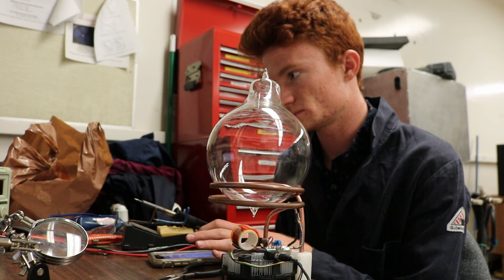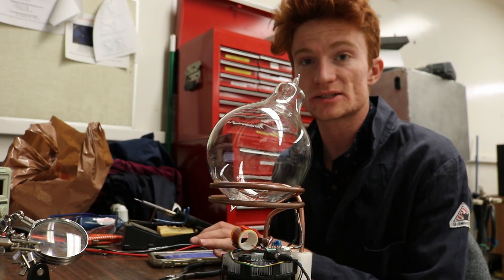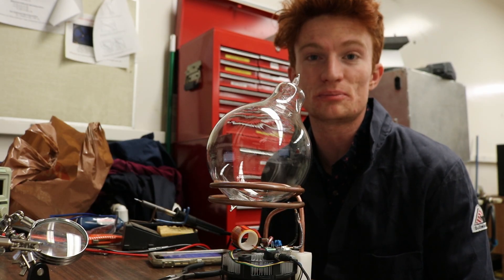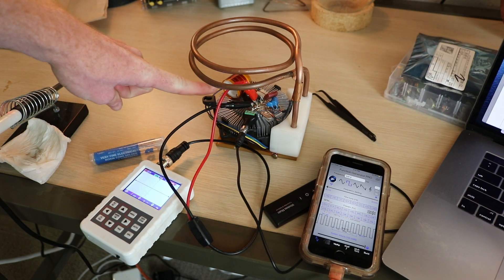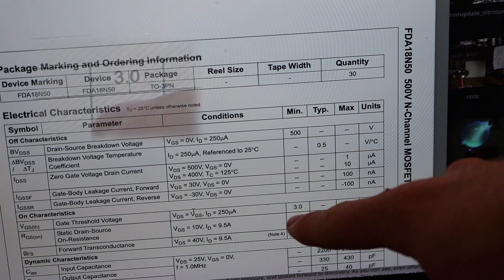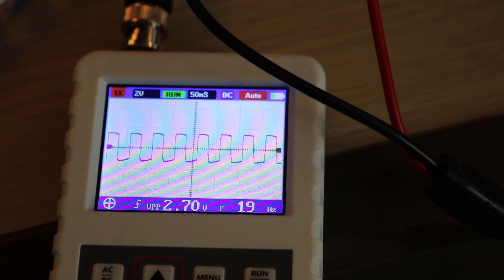Now that we've got the second generation of the plasma toroid driver, let's see if this one will make music. No oscillations are starting. I think going forward I'll get an oscilloscope so we can scope it and see what's happening. So this is the new circuit with the new MOSFET FDA18N50. Looking at the datasheet, the lowest voltage needed to turn on the switch is 3 volts, but the maximum output voltage from the Bluetooth receiver is 2.7 volts — so I can't use that Bluetooth receiver as the signal generator for my new circuit.